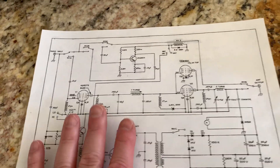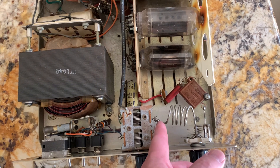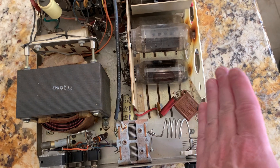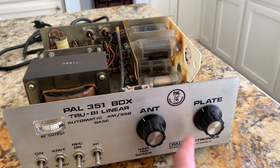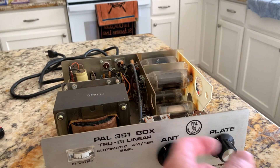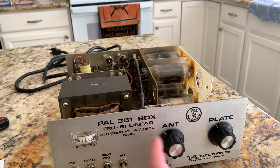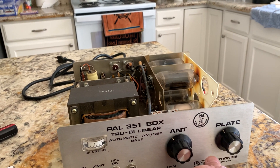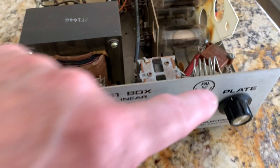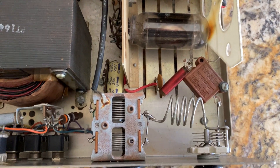That'll broadband that part of it up. I think I've got another amp in the garage with the same size coil, so I can disconnect this and solder them both together, reposition them. Then I can drill a hole here to add a band selector switch — tap this coil in different spots to get it to work from 10, 12, 15, 17, and 20 meters.